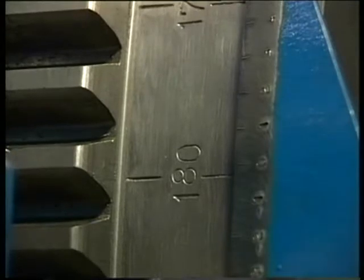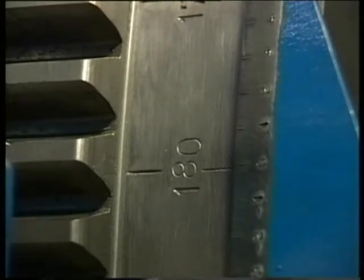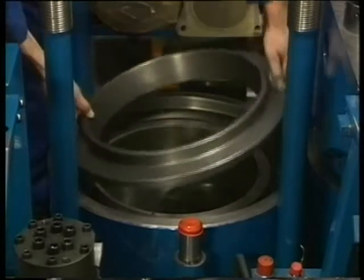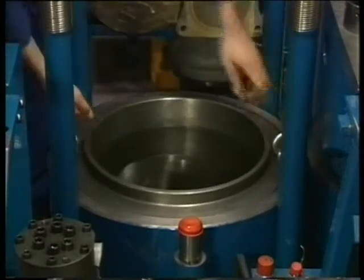Turn the crank of the relevant cylinder to the bottom dead center and clean the cylinder liner before the piston is installed. Provide the guide ring on the top side of the cylinder liner to guide the piston rings into the liner.